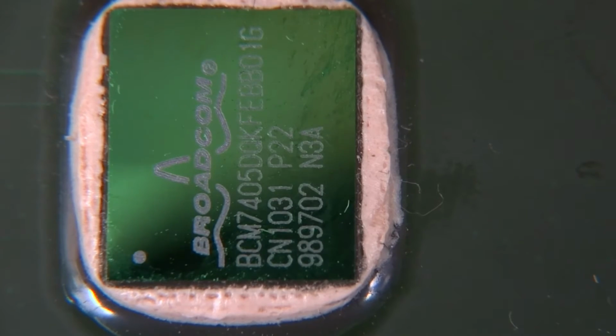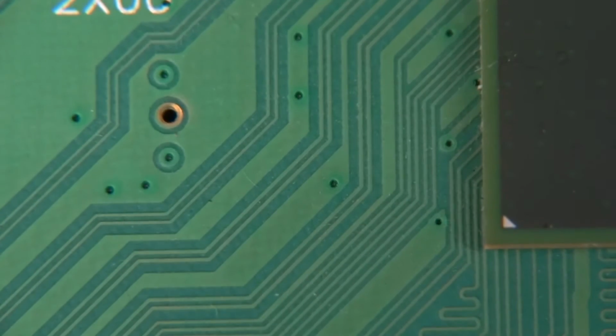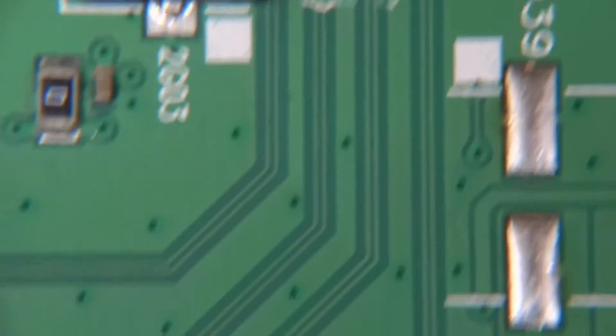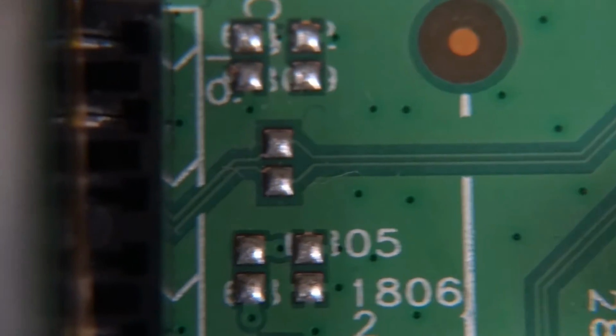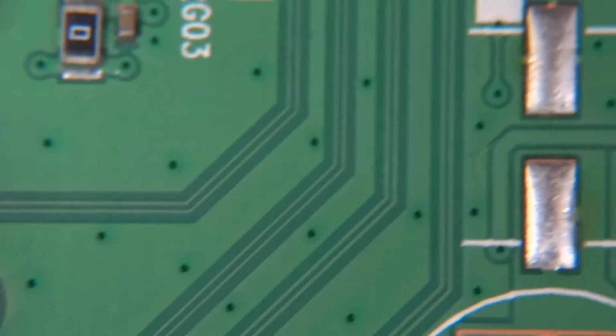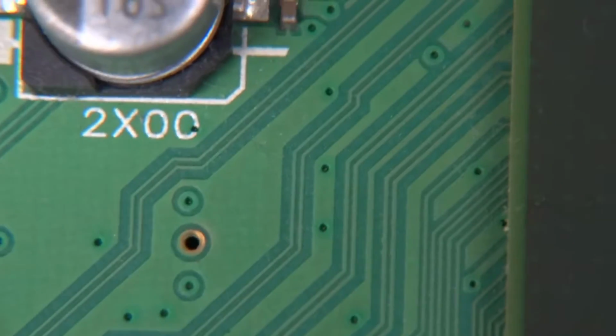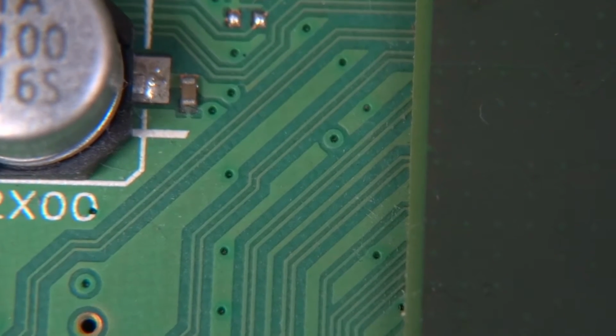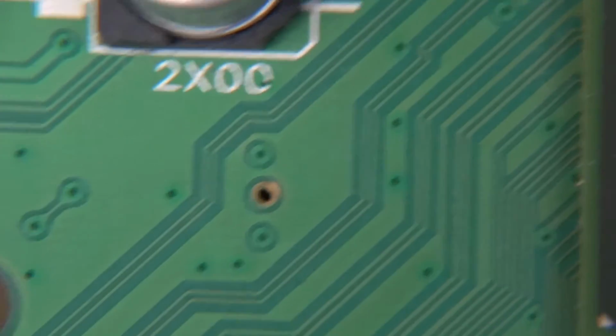Now it's quite interesting when you look at the PCB. Over here you've got very distinct pairs. Those are differential pairs of signal going through, and you might wonder what those are. So that goes all the way down to the bottom of the board, or one end of it, and disappears in this can. And what it is, it's a USB connector. It's really important that, you know, USB you cannot just hook up with two random wires. It's just much too fast for it. The data flow is too quick, and that's not going to work. The cable's got to be shielded, and if it's a cable, it's twisted pairs in a certain way. And if those are tracks on a PCB, you've got to do them like this, so they're exactly the same length and whatnot. There is a whole subject to this.